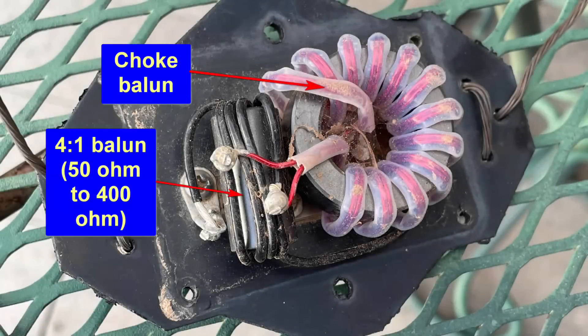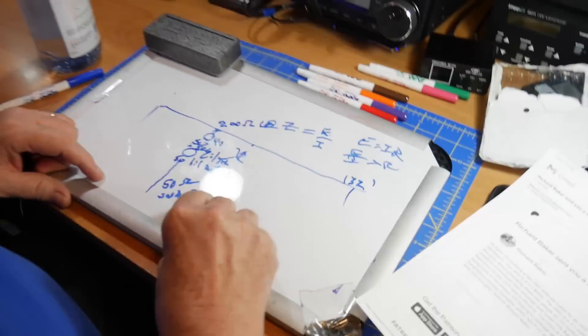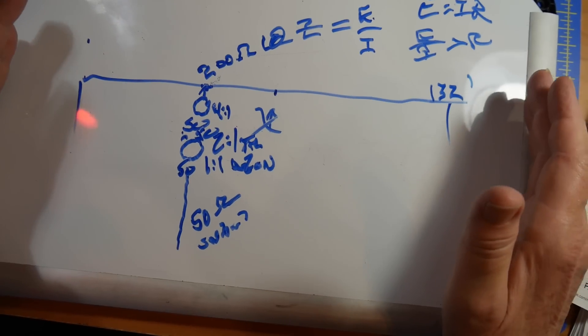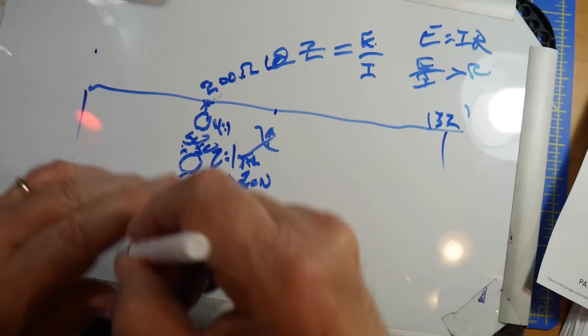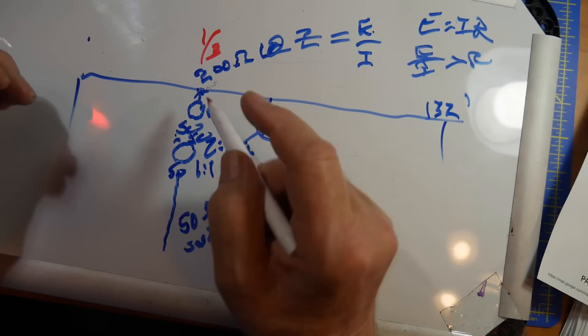So this is a picture right here of the balun that is inside. You see that there are two baluns — one is to separate the coax shield from connecting in, and the other is to actually do the transformer action. One is a voltage balun, the other is a current balun. So that allows us to basically — what you're building here is an off-center fed dipole. It's fed at the one-third point, so this distance is two-thirds, and this distance is one-third.